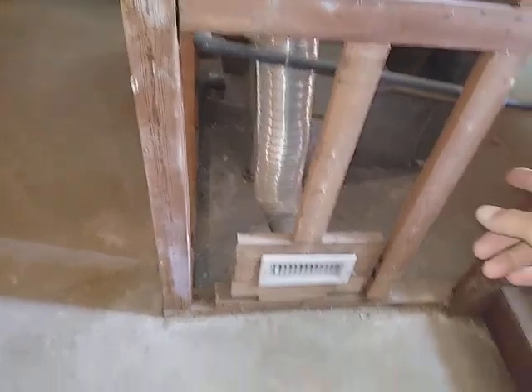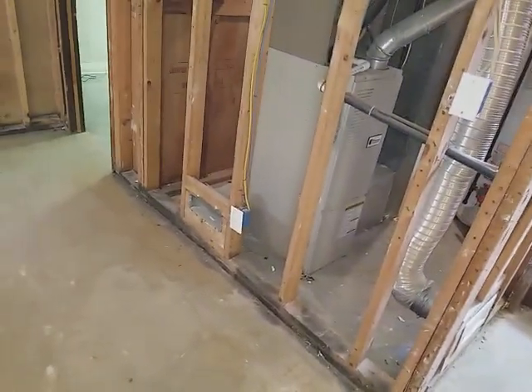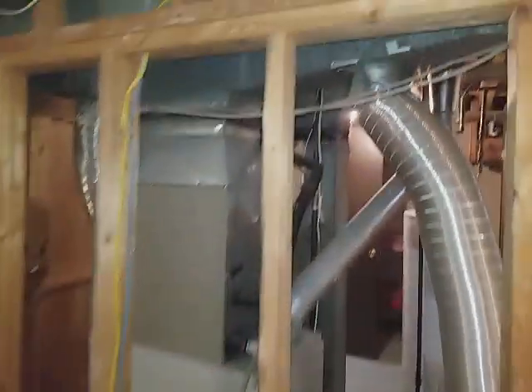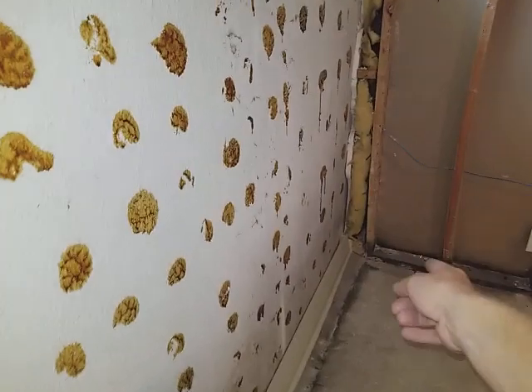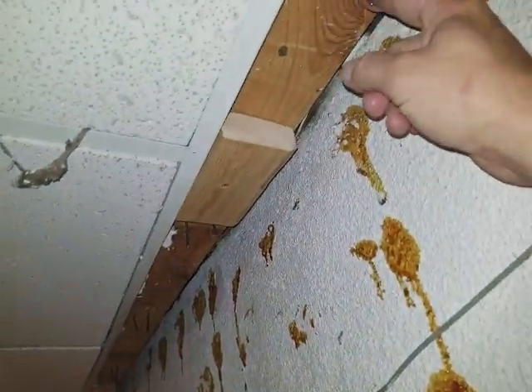You will need some ceiling tiles. The walls here were always left bare — put T111 up; that was straight from Bill. All these walls that are bare, all the way up to the ceiling, same thing over there. Clean up the drywall and go all the way to the wall. Make a notch for the BeaverDry I put in and just go flush with the wall. These are supported — you might need a new ceiling tile here just to keep it flush. Had it come down because of all the walls coming down so we could put the BeaverDry in. I don't have my cut-off tool with me — so cut off these nails down there.